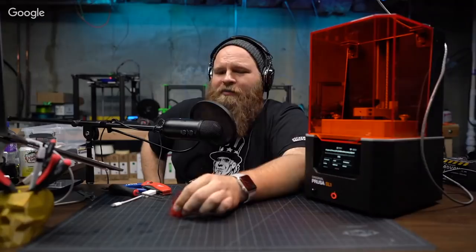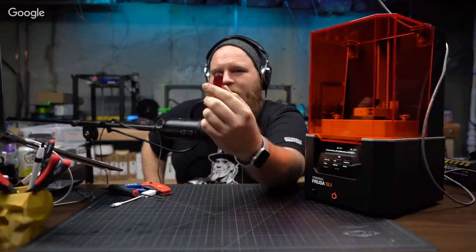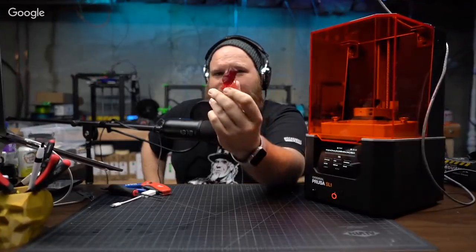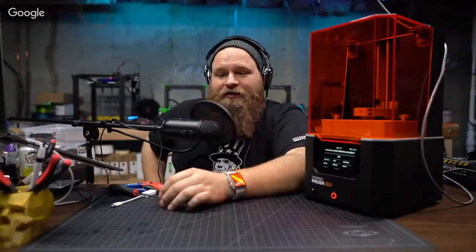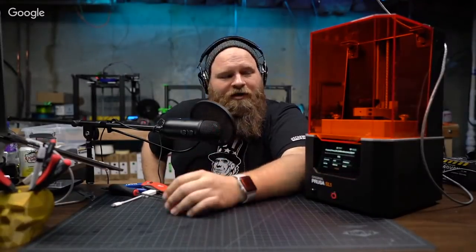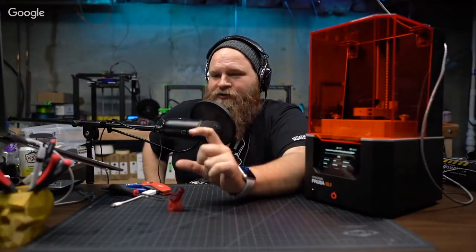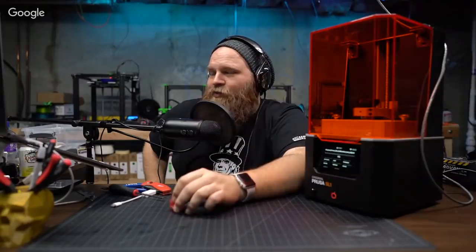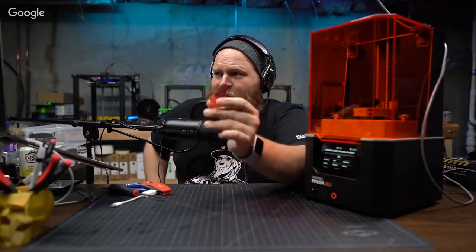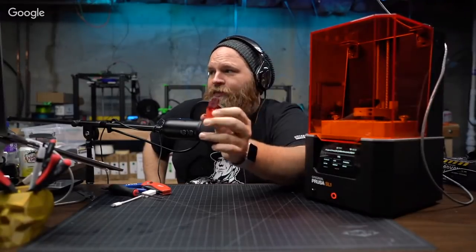Oh boy, if I were to print this mini in the same quality, I'd probably need a 0.25 millimeter nozzle. Printing this tiny mini with all the supports and everything would probably take forever. This print would take about 4 hours. The print that's in there right now takes 4 hours, and it's a really super detailed model of Joseph with a bunch of things on it. So print times can be lower, and if I print 10 of these on a build plate, it takes the same amount of time as it takes to print one.